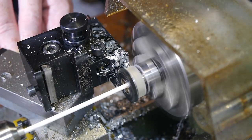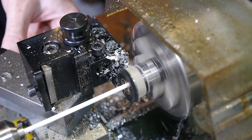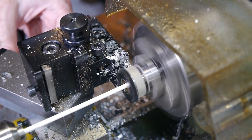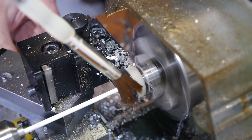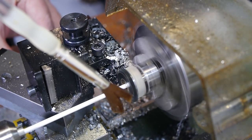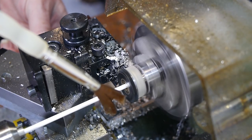As soon as the tool breaks through the aluminium into the brass liner, the part starts to slip and wobble, though I didn't initially notice while I was taking the cut. This is because the brass isn't firmly bonded near the bottom of the hole, and the part is now largely being held in place by the parting tool and the groove it has cut in the brass.